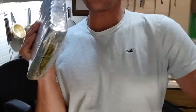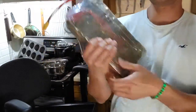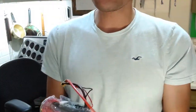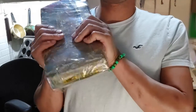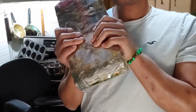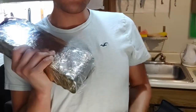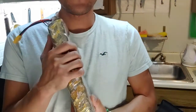Thank you for watching. I built my first 12S4P with 21700 Tesla Samsung 40T batteries. The capacity on this is almost 700 watt hours with continuous discharge of 140 amps. But I only run it at half of that just to stay safe and to keep your battery lasting a lot longer.